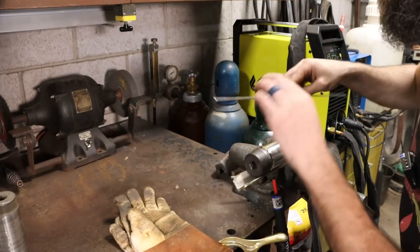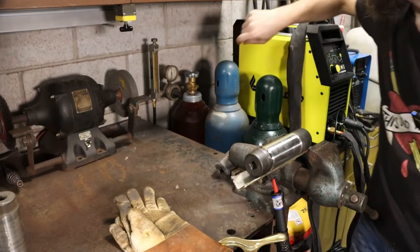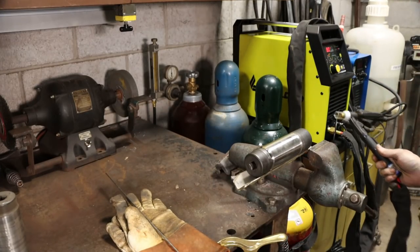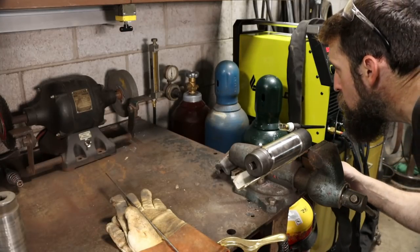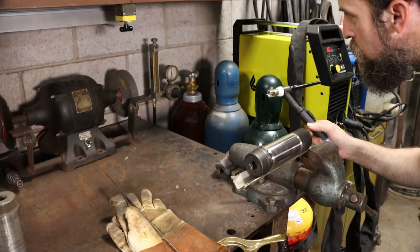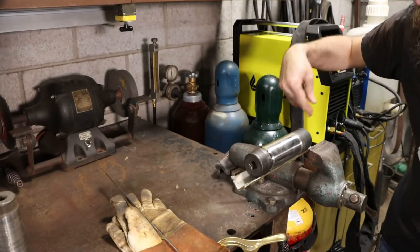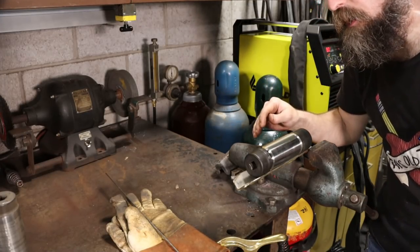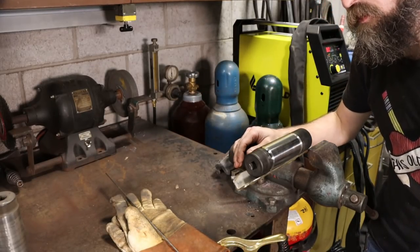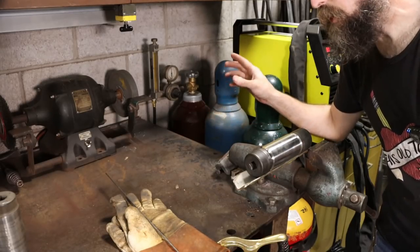I'm using ER-308L stainless steel filler rod and I'm going to start out at probably about 80 amps and see how that acts. I've got to check what my gas flow is — just changed this tank, and who knows if I've bumped the regulator. I'm at about 10 standard cubic feet per minute, maybe 10 or 12. That's a little on the low side; usually I run around 15 in a no-draft area. Any more gas than you really need is waste, so experiment with your gas on a scrap piece — you may be able to make your tank last twice as long if you carefully adjust the flow.